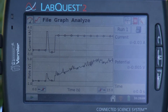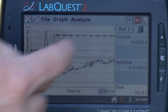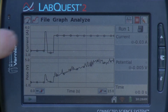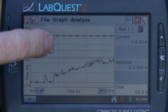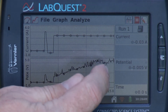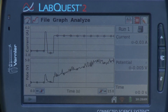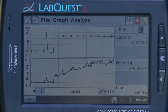Now we have some data. At first, when I was attaching the wire, I attached and unattached it, so there's a little bobble there. Then we see the current jumps up. The voltage actually begins to increase a little as the motor begins to spin up — we get a little back EMF — and at some point it reaches a maximum. It takes a few seconds for it to get up to full power.